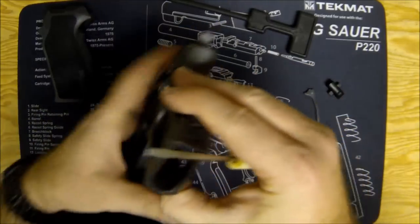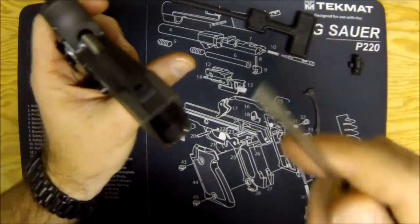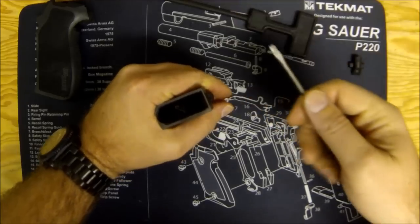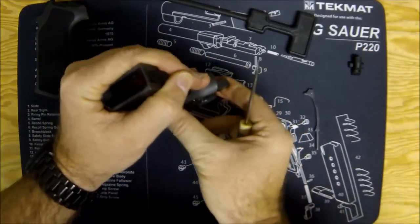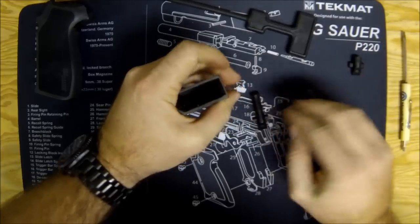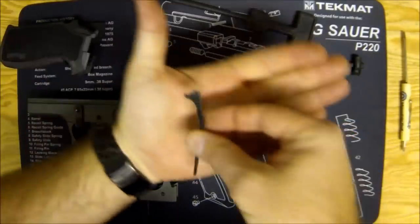Let's pull the old foot off, then remove the mainspring and guide. You'll need a small flathead screwdriver that fits in the groove on the foot. Hold your hand over the spring — it has spring tension. Put your screwdriver in the groove, have the hammer back so it doesn't get in the way, push down, and it comes out smoothly. There's the foot, and you can pull out the mainspring guide and spring all as one piece.